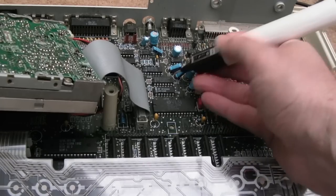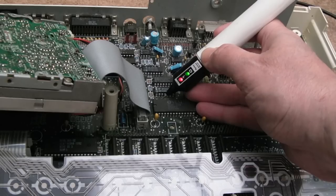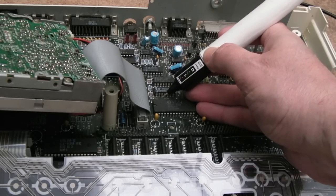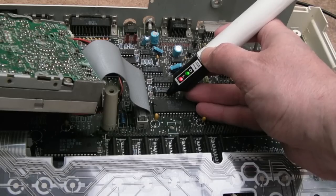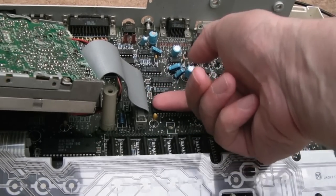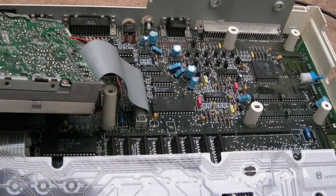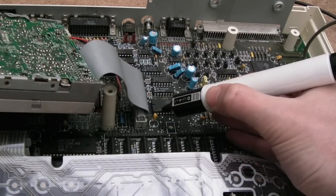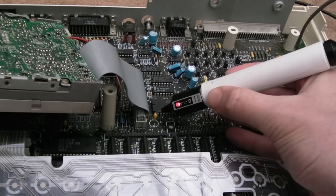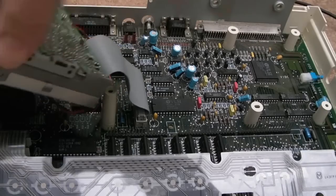The next thing I did, while this noise is going on here, is probe the pins around this. Interestingly enough, pin 3 seems to follow a pattern of the noise, like when the noise starts to slow down and stop, the pulsing stops. I then looked at the pinout of this. I think that's the seek pin or something, I could be wrong. But I thought, well, what's going on here? It's like the drive is getting instructions when it shouldn't be. If we have a look at the chip select down here, that's high. So that's weird. Anyway, let me switch it off.